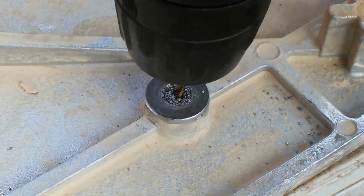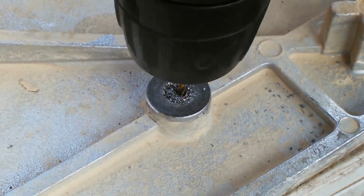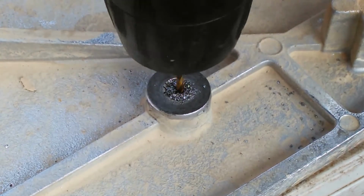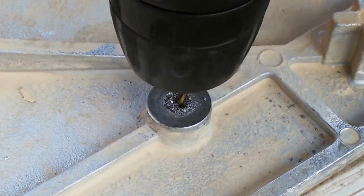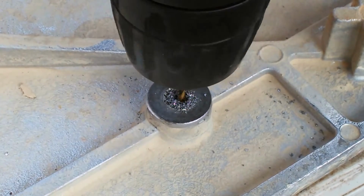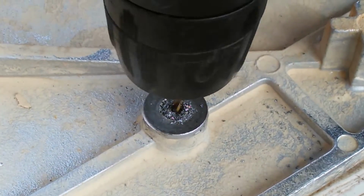So obviously, the drill motion is moving in the direction of tightening a bolt. So whatever I do, if I decide to twist the threads out, I'll have to twist them out in reverse. I have a feeling that there was some type of cement or something used on this bolt, or maybe it was cross-threaded as I originally suspected, because it's just not backing out of here.